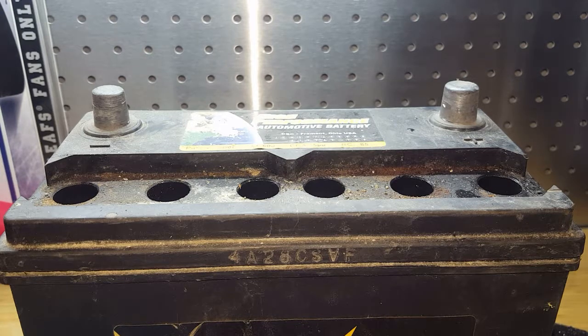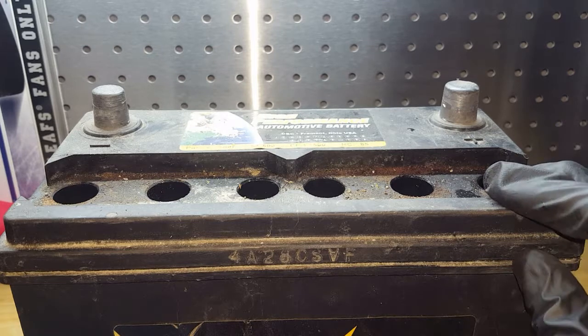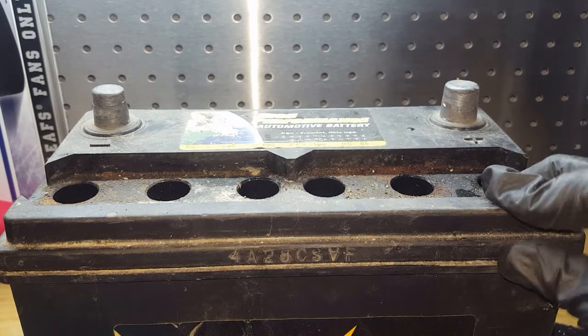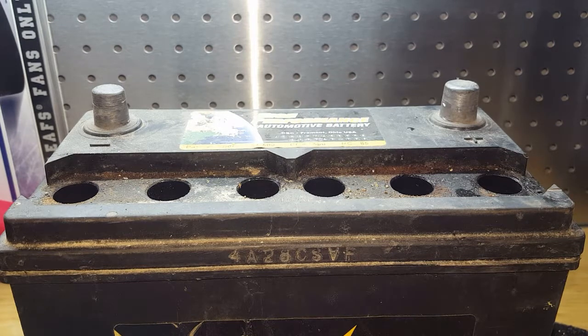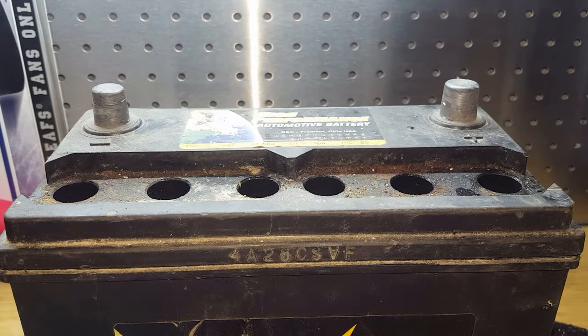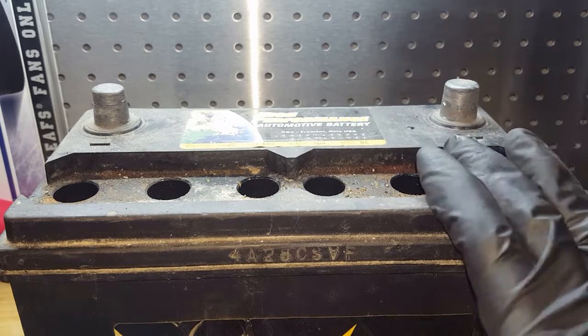For a good battery, it's usually between 1.300 and 1.280. That's usually a good battery. What's in batteries is sulfuric acid, mixed with the water. There's obviously a certain amount. You can't just pour sulfuric acid in and hope the battery is going to work. It's actually a process. I just want to inform you that this battery is no good.